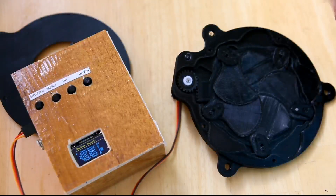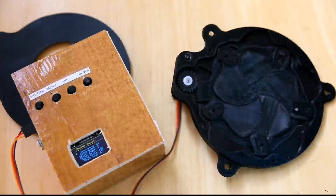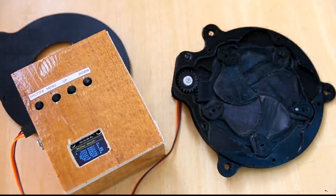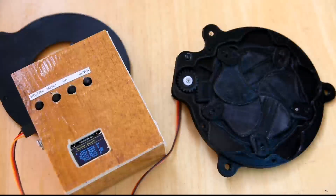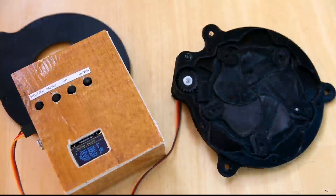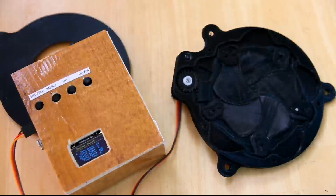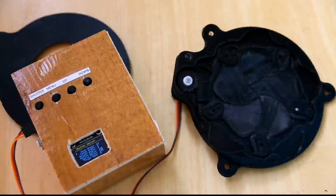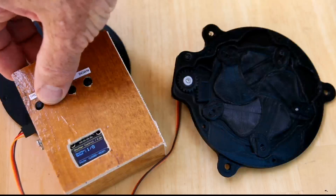The configuration menu is kind of complicated but it gives you all the capabilities you need to set up your shutter without having to reprogram it. You have your closed shutter angle for your servo, your open shutter angle, and what I call a 'relief angle' — if the shutter is stiff the servo motor will buzz, so the relief angle backs off by however many degrees you specify; I have four degrees set. I also have a servo delay parameter for how fast the servo operates, which is for flash sync. Flash sync hasn't been tested yet, but I do have X sync and M sync — X times the flash when fully open, M sync times the flash at 20 milliseconds before that.